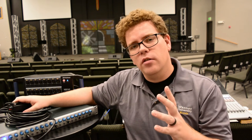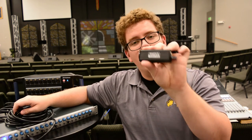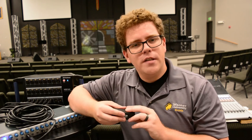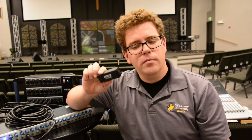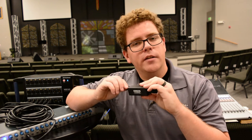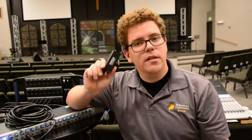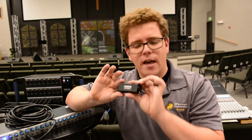Here's what makes these tools really great: first off, this is going to cost you a lot less per individual channel. This volume attenuator from Elite Core Audio costs about $32 to $33 per little box. So to support six in-ear monitor mixes, I need six of these at $32 per channel — very affordable, and much less than the five to eight hundred dollars I would need for a wireless in-ear system. However, this alone is insufficient — this is a headphone volume attenuator, not a headphone amp.